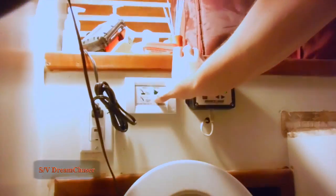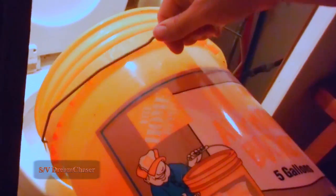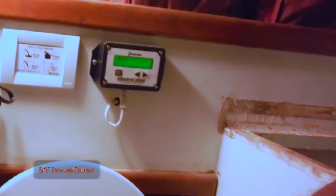A good bit of reference information is the amount of fluid that fits within a piece of hose. On a boat, most boats use a 1.5 inch diameter sanitation hose. That means that one gallon will take up about 10 feet 6 inches of that hose. You can use that to calculate just how much water you need to run through the plumbing system in order to clear the lines all the way to the ElectroScan unit.